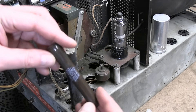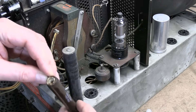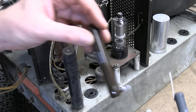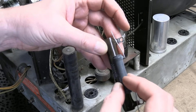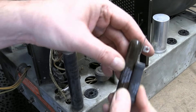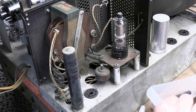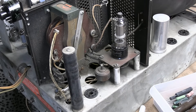That's a 25 watt resistor — this is a modern 50 watt and even so it's smaller, but it's close enough. I might have to use the mounting kit for the screw since it's a little bit shorter, otherwise I could cut the screw down. The nice thing is these are available and you can reuse the mounting. If I put this 20K in parallel with a 7500 it gets me in the ballpark of the needed value, and these leads are splayed out so you can put them right through these eyelets — it works out very nicely. I bought a bunch of these because I was restoring a bunch of these sets and encountering so many bad ones. They're not cheap — about 10 bucks each — but they're still made and available.